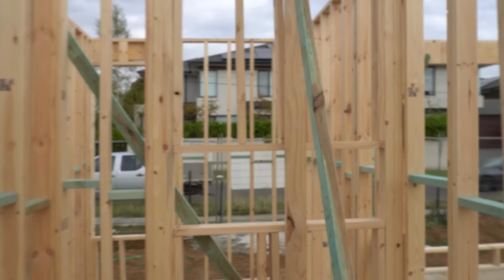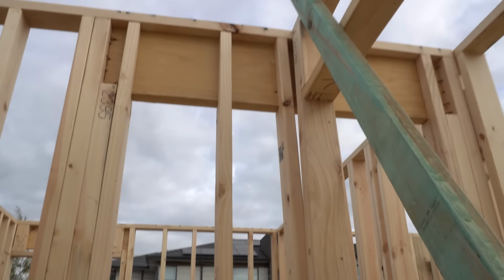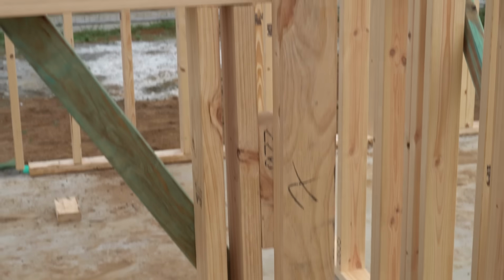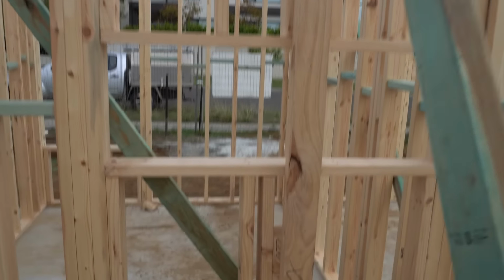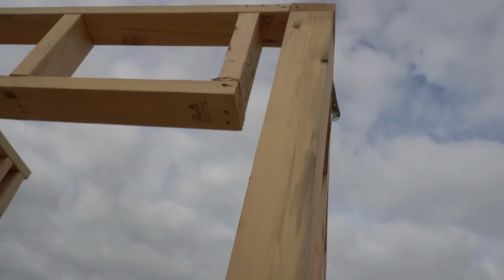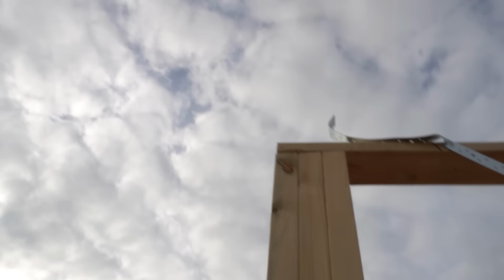One of the reasons we're so far behind today is with how many issues these prefab walls have had. I'm just trying to show these junctions here, and it might be easier from this side. Little stuff like that, where we got the junction following up there from the niche, and then on the top, the studs are completely out, leading out the other side. Obviously we haven't fixed that, but there's been so many areas like this where we've had to pull studs out because the studs have all been sticking out past the top plate.